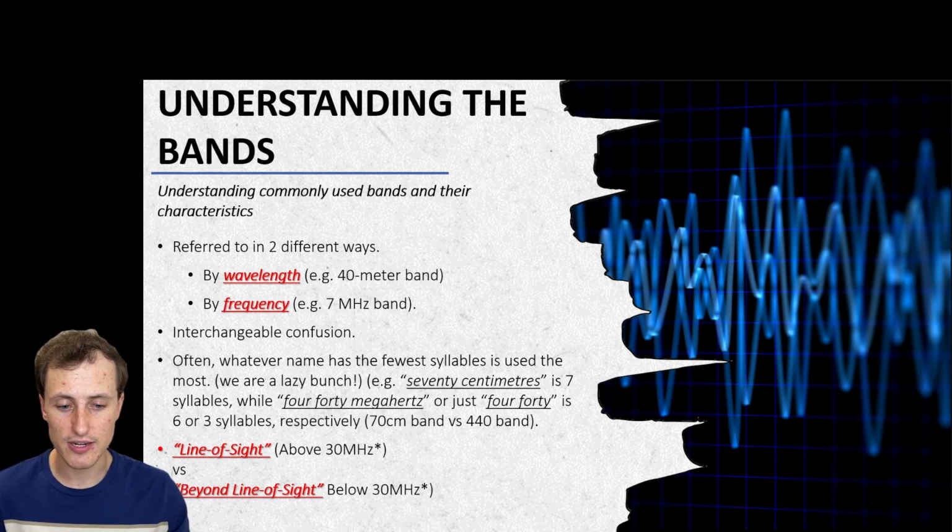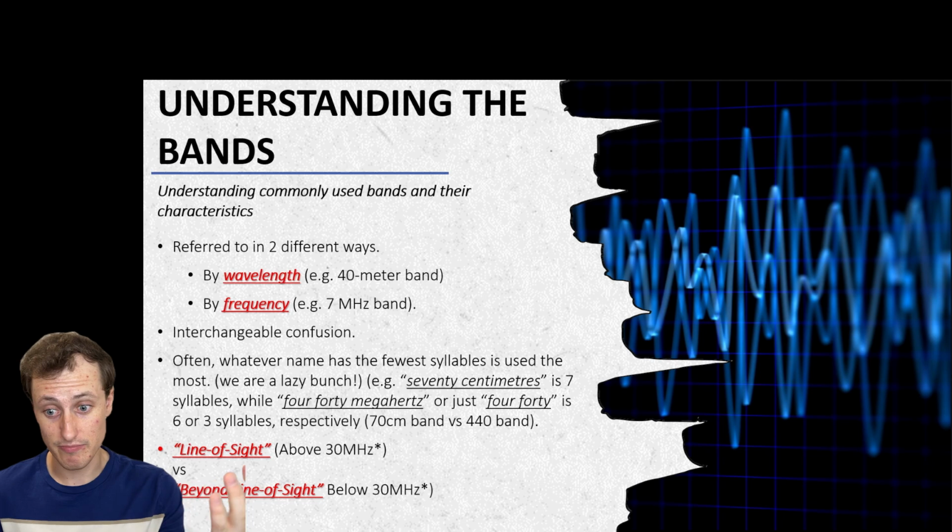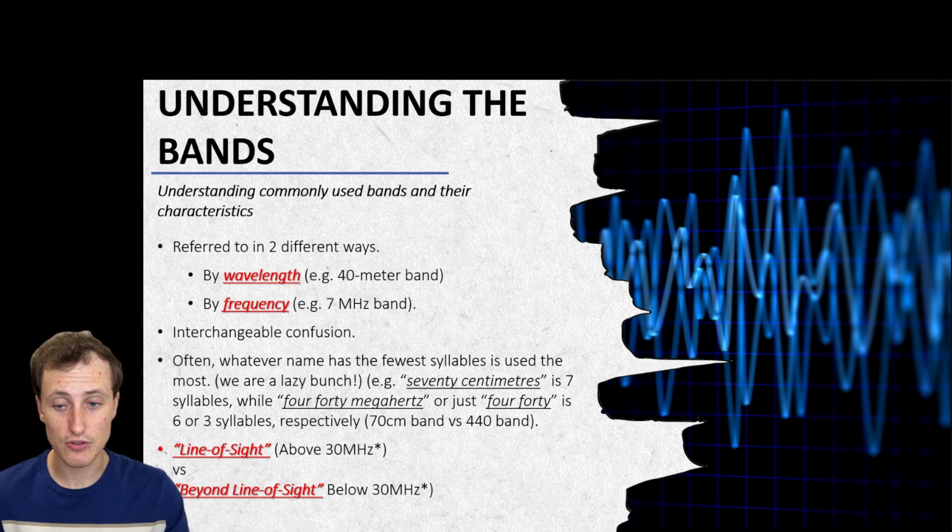There are definitely exceptions, for example, like the 6 meter band, or even VHF tropoducting that we get on 2 meters under ideal conditions. That allows us to talk way further, sometimes even hundreds of kilometers or miles away. They do break this rule, obviously, and there are other examples, but I just did this for ease of conceptualization for beginners.